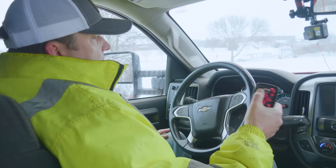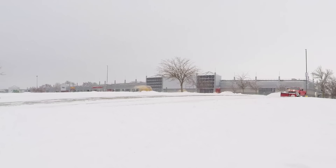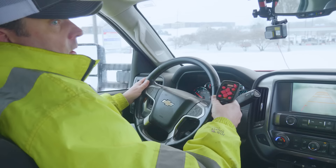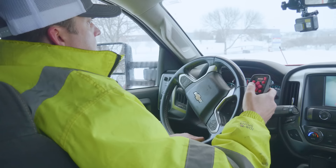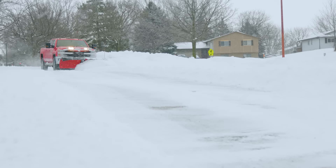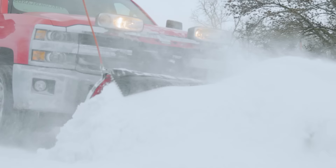This is where that V formation comes in — having that and just aiming right down the center. That'll scoop all that up and push it through right there at the end. You do want to be careful at the end — if you want to keep pushing it forward, this is also where I've seen plows get stuck. There's the undercarriage or that plow where it'll get stuck if you keep pushing too far through that. Now after you get good and know your spot, slow is definitely the best way to start. But having a little bit of momentum pushing forward — that snow starts rolling forward. So as you get better, hopefully you'll pick up a little bit of speed.